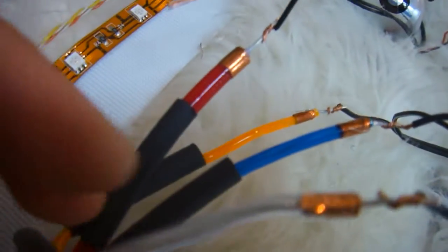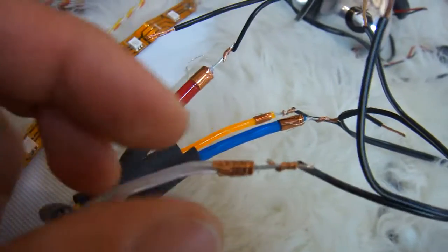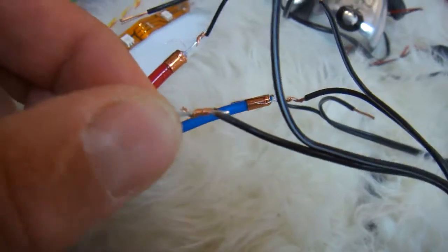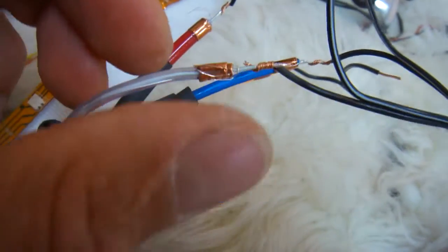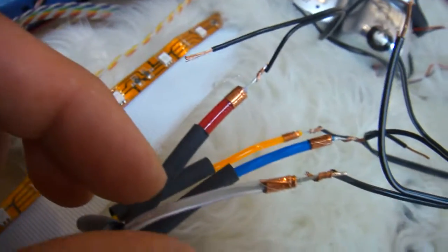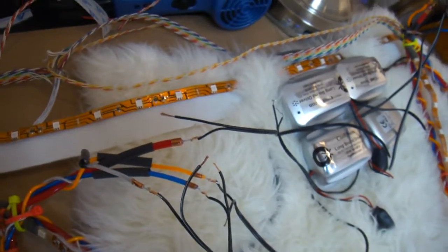What you got to do is strip back the vinyl coating on the EL wire, and then the easiest way is this right here — it's this adhesive-backed copper tape. Use that as strain relief for the very fine conductors that wrap around the center wire. We're gonna go ahead and solder these up, and then the connections for the pants will be done.